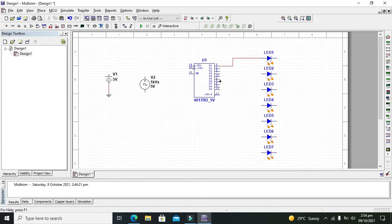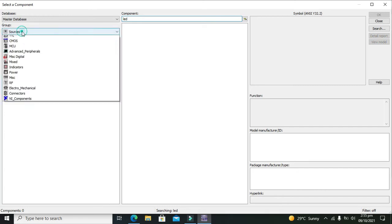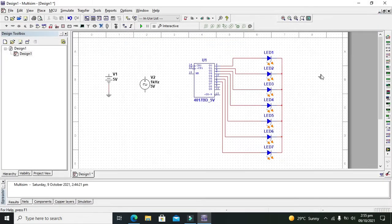1, 2, 3, 4, 5, 6, and 7 LEDs are there. We can connect some more, but we'll go with 7 LEDs. Now we need to connect all the negative sides with one another and then connect them to the ground, because the LED cathode sides must be connected with the ground for best operation.